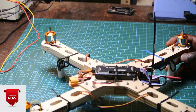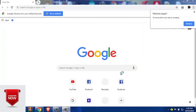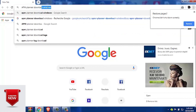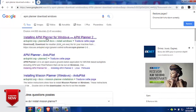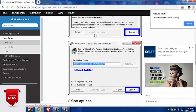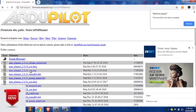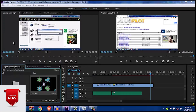With all this done, we are ready to configure the flight controller. Now that we have the drone set up, let's configure the controller. To do this, we're going to download the Mission Planner software. We go into our browser and type in 'APM Mission Planner software download for Windows' and follow the instructions on the website. To configure the sensors, we plug the controller into the computer and upload the firmware.